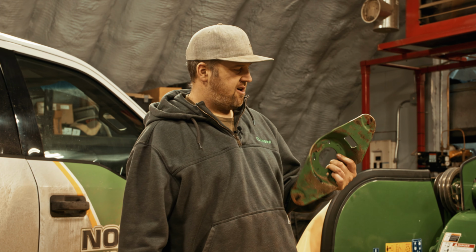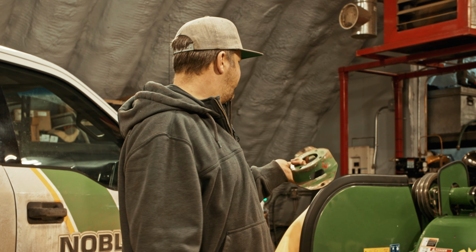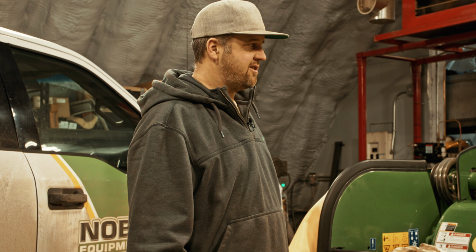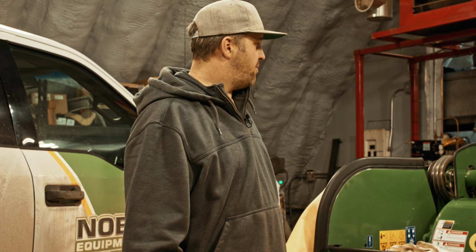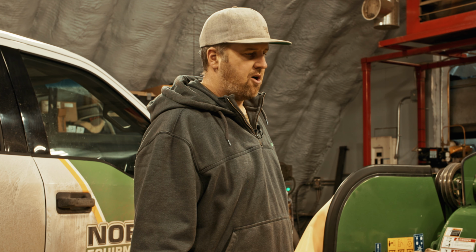The winter check program didn't find really much wrong. We found a turtle that was loose on the rear cutters, and we found this cracked spring plate and a couple springs for some belts that were not out of spec, but on the lower end of spec. So we've made adjustments to some spring tensions and stuff like that, which is to be expected. They're new cutters, and obviously they've got a break-in. So belts and spring tensions have broken in now, so now they need their first adjustment. So all that's been done and caught prior to it being a problem.